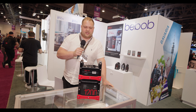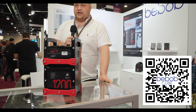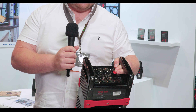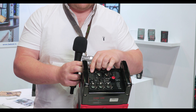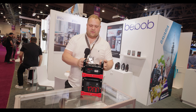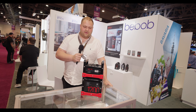Last but not least, we're moving on to our cube battery — block battery if you like. This is a 1200 watt hour battery with multiple different outputs. We have three 12 volt outputs — two here and then one on the D-TAP — two 24 volt outputs, and we also have a 48 volt output. You can run the SkyPanel S60 or S120 on full power for over two and a half hours with this battery.